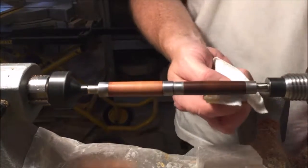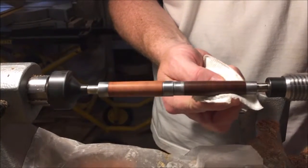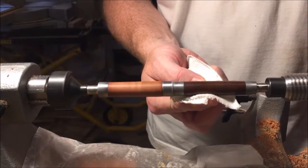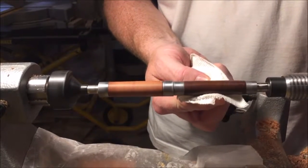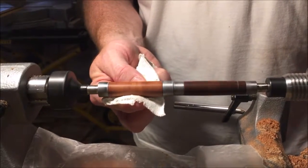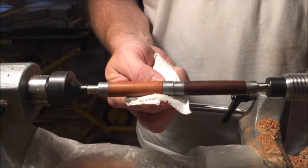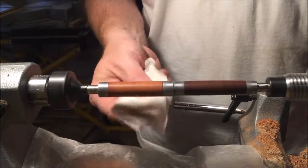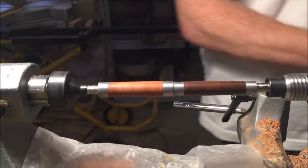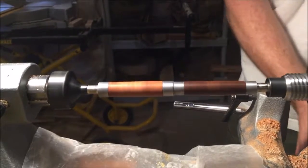When I want a nice shiny finish, I'll apply some car wax. This goes on like normal, goes on wet. As you apply it, you'll see it turn into almost a water. You want to let it dry just a little bit so that it gets a bit of a haze, and then buff it off with some form of cloth. I usually do 2-3 coats, depending on the piece of wood. The shinier you want it, the more coats you'll put in it.